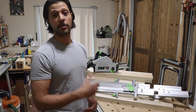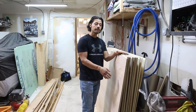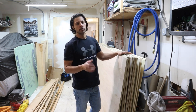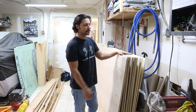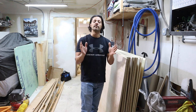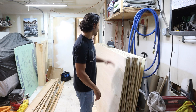That's how all good cabinet carcasses start — with some good sheet goods. I'm using three-quarter birch ply; try to get the straightest you can find. No matter what you do they're going to twist and warp into pretzels and potato chips, but when you're building a box the structure of it will square everything up once it gets nailed and screwed together.